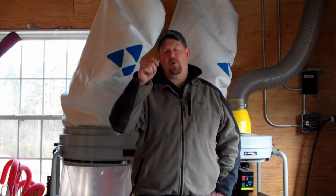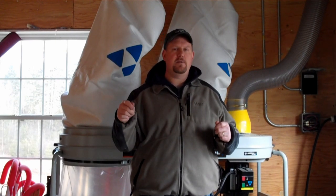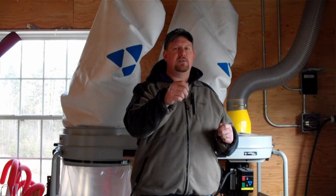This dust collector is set up so that I can turn it on and off from any piece of equipment in my shop. It sounds complicated but it's actually really easy to do. We're using a combination of three- and four-way switches upstairs positioned at each one of the workstations. For example, I have a switch right at my miter saw, one right at the table saw, one at the band saw, the drill press, etc. Any one of those switches can turn it off or turn it on — you can start at the table saw and walk over and turn it off at a different station. Any switch will operate just like a normal three- and four-way switch in your home.